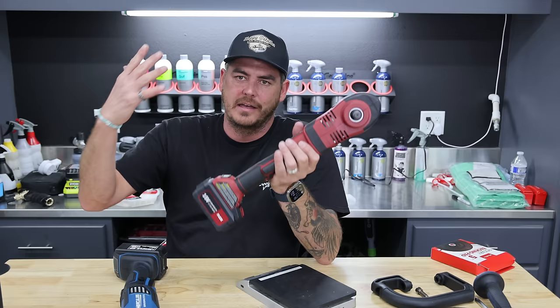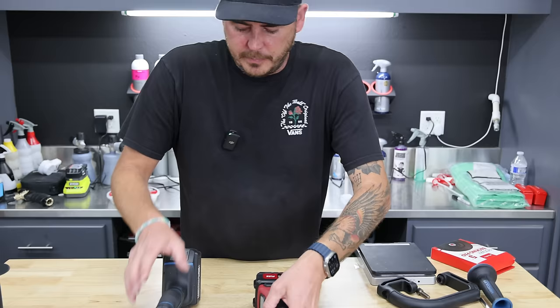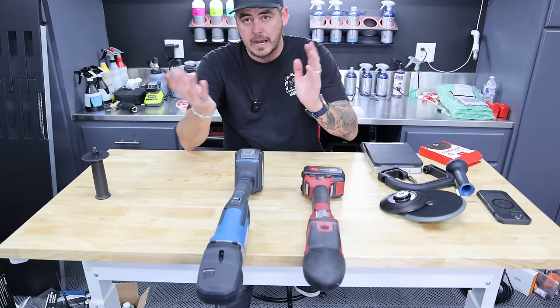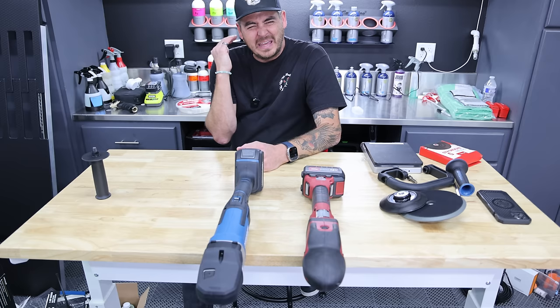Let's go ahead and turn the batteries on. We're just going to let both run until they die, note how long they last, and take temperature readings at the head. I'm running both at full power — that'll give us the least run time but a good expectation for full-speed use. Both batteries are fully charged. Pulling the triggers and locking them in — there they go. As you can see, neither of them have budged; vibration is quite low, which makes sense since it's a single spindle with no offset. Noise-wise, the Hercules is louder — a higher pitch, a little more piercing on the ear than the Flex, but again — a hundred bucks.